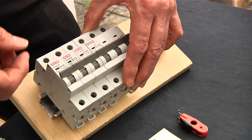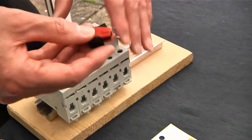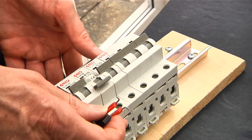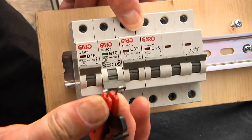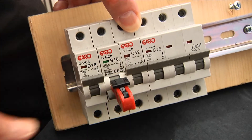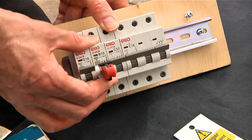We do have a variety of different tools available that help us deal with that situation. If we turn that circuit breaker off we then have a tool like this where we can squeeze those prongs together, and the circuit breakers come with holes in the side so that those prongs can be inserted into there. Having inserted it, if we then push that in, it can no longer be squeezed and therefore cannot be removed. That's held that breaker off very securely.